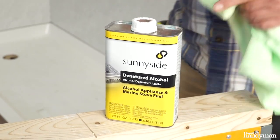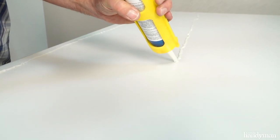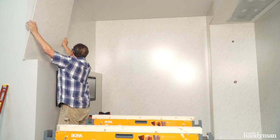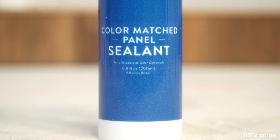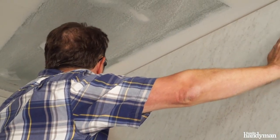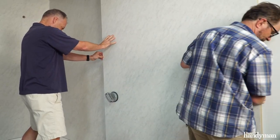Clean the back of each panel as well as the wall itself. Apply adhesive to the back of the panels according to the manufacturer's recommendation. To install the panels, press the first panel into place. Apply a bead of color-matched seam sealer to the tongue on the panel. Then apply adhesive to the back of the next panel and install it. These joints are tight, so have a helper — tile-setting suction cups are also a big help.